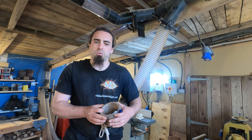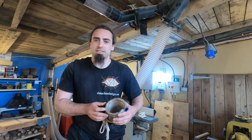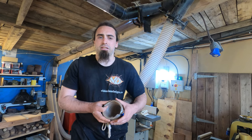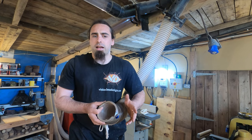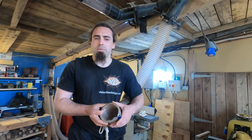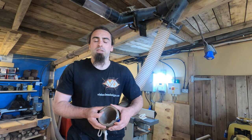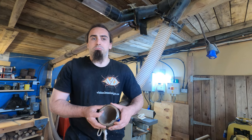On to possible safety with these now. One thing when it came to extraction that I had a lot of people go on about was static — static build-up on all the plastic piping and how you need to do everything you can to prevent it. When I first built the extraction system, I was looking at getting the anti-static kits — basically wrapping copper wire all around the piping or putting it through the system itself, putting nails through it all — or what I was thinking of was metal blast gates and earthing them out. I've since gone with nothing.